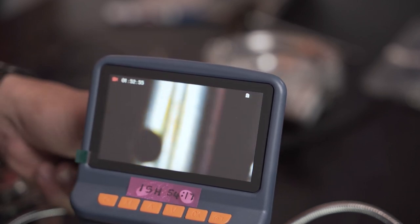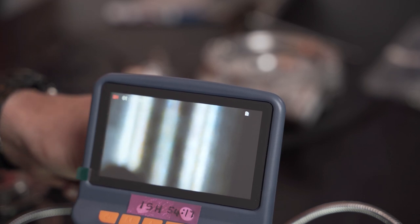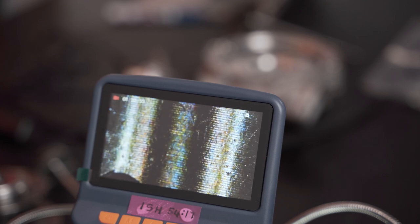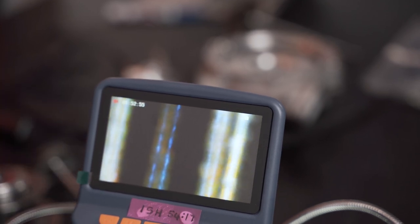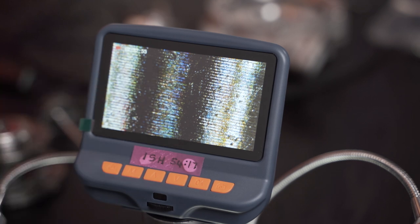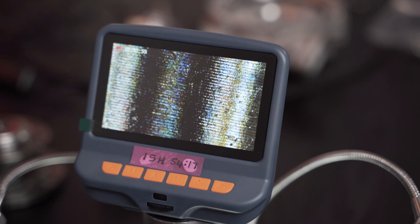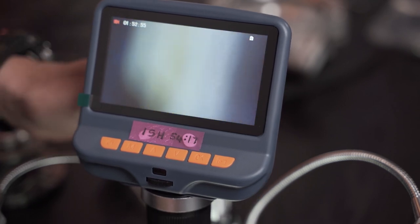Now you can clearly see the bearing is shiny. I mean, it's got a beautiful smooth finish, and your bronze type materials, they're lovely to machine. They machine very nicely. But what you're not seeing is, look at that surface. Can you see, I'll even zoom in a little bit more. Have a look at the striations on the surface of that bearing. They're not smooth, by no means. So the shaft has got a surface finish or a surface roughness, and the bearing's got a surface roughness. The same surface roughness you will find on the inside of the bearing as well, where the shaft runs.